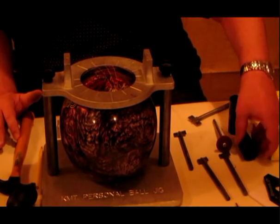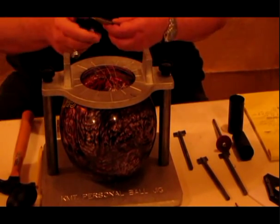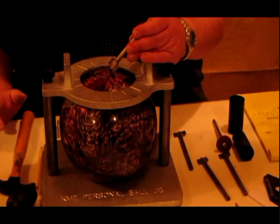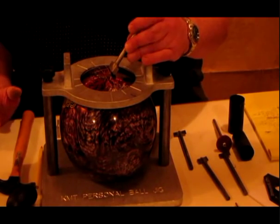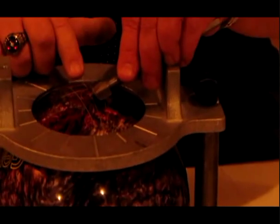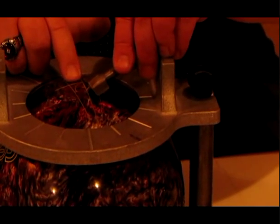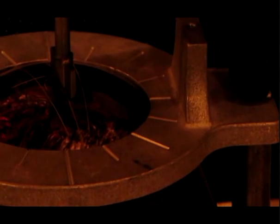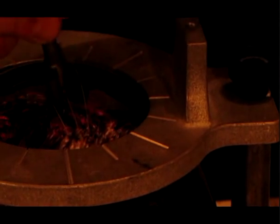Now, what I need to do is to line up this 1.5 inch bit so that the point is on the center line and the edge doesn't take this top of the thumb hole line. So I'm lining up the edge of the bit on the thumb hole line, putting the point on the center line, verifying it, and I'm going to make a little mark with it.